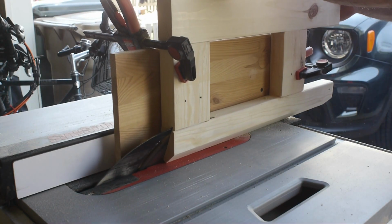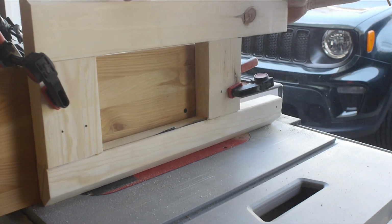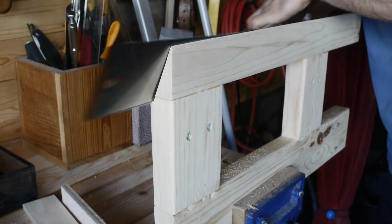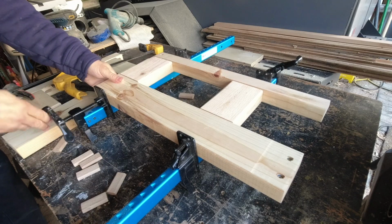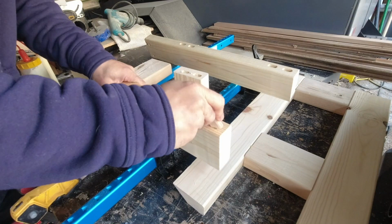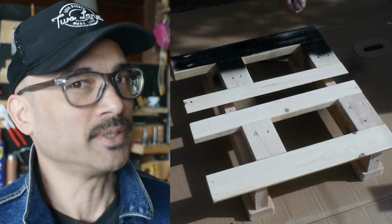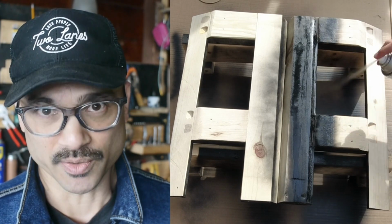Most table saws won't allow the complementary angle of 67.5 degrees to be cut in the range that it offers, so I had to build a panel cutting sled to get that severe angle. The legs are just 2x4 scrap lumber that I found in the garage, and I spray painted them black so they blend into the corner shadows.